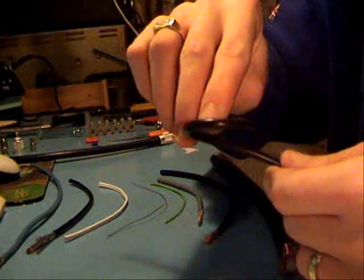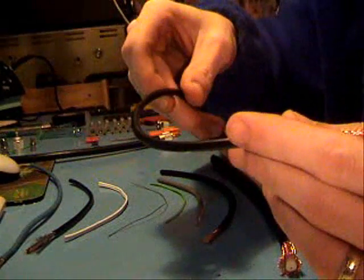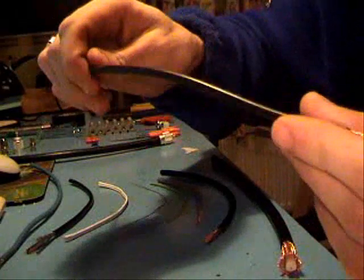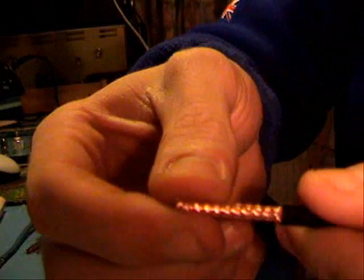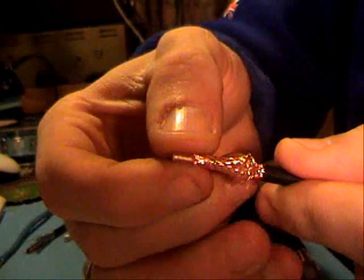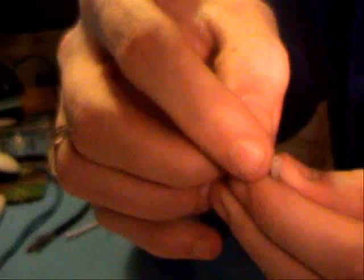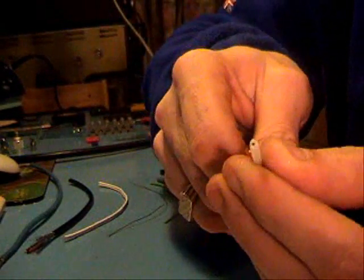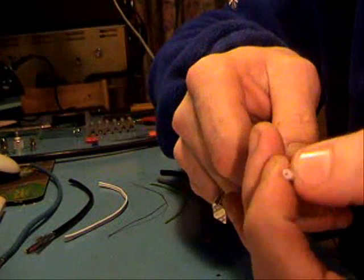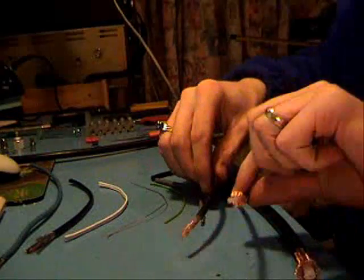This one's a lot more flexible — it's got a smaller bend radius. It's used in mobile setups in your car. It's called an RG58U. This is a military spec, same with this one here — the very tight weave. It's a bit easier to move around. But this one's different because it's actually multi-core inside there. That's also 50 ohms as well.